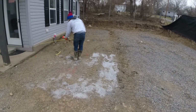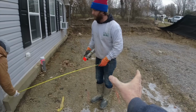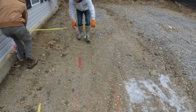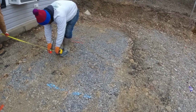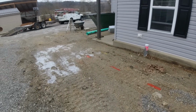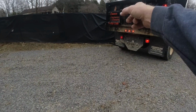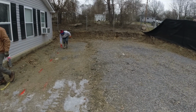Okay, this is the dig area. Outside of the wall is 5 feet from the building. How wide is their wall? Well, block, 8 inch, 10 inch, 8 inch block. 2-foot wide footer. So footer, 8 inches in from that. Back here to our corner. Here's our water line. We did the one call. We know it's right in here, as well as a gas line running right through here. Right by my back tire, out on the street, we see some yellow indicator marks. So hopefully we're behind that, and we're definitely going to see that water line.